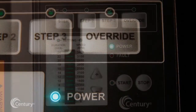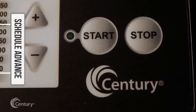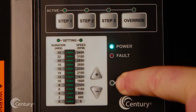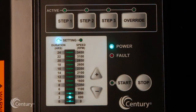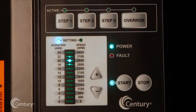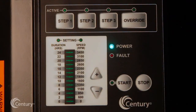The V-Green 165 has a schedule advance mode that allows a user to press the start key at one time of day, with the 24-hour schedule starting at a different time of day. To take advantage of the schedule advance feature, press and hold the start key for more than 3 seconds. The start LED will begin to blink and the duration LED will be illuminated. Press the up or down arrows to set the desired delay time. The schedule advance mode can be cancelled by pressing the stop key. The override feature will still function with schedule advance mode active.